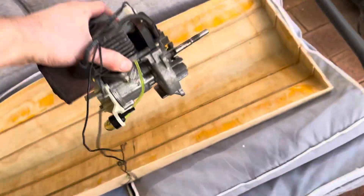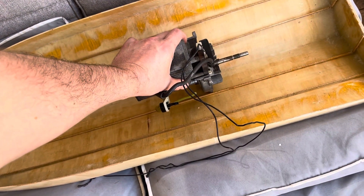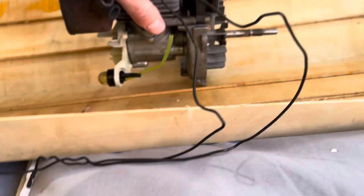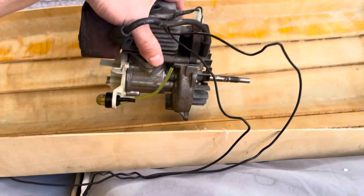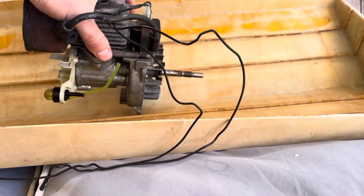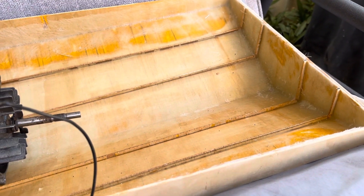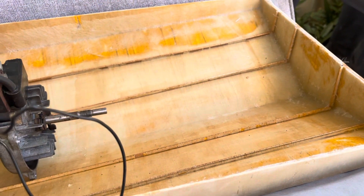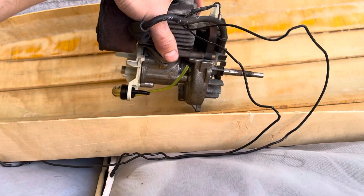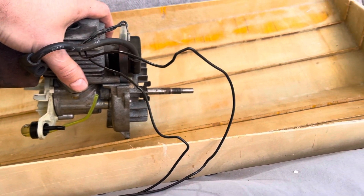So essentially it's going to sit like this, and I want it to be about one third of the way back initially and we can further refine that. But it's going to be a bit higher and slightly offset, and that's going to allow the flex shaft to go down to a union down here, and that union will connect the flex shaft to the drive shaft of the propeller. By offsetting it, we will be able to reduce the angle at which those two meet.